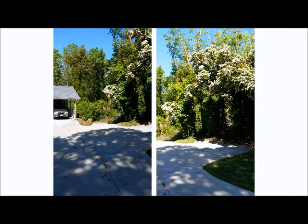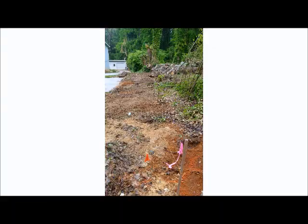First, we had to take down several trees and clear out a lot of undergrowth. After tree removal was complete, we removed the stumps, located the utilities, and pulled the strings so that we could mark our post locations.